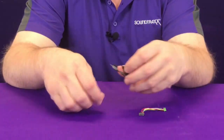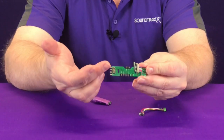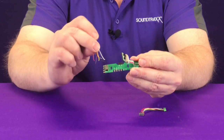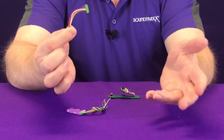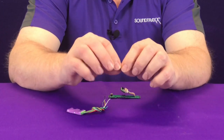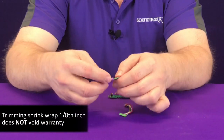When doing an installation, you can hardwire this into your model, or if you have a circuit board like this one — which came out of an Athearn Genesis with an 8-pin socket — you can either take the wires and solder them directly to the connector, or you can purchase our adapter harness, part number 810135. This has the nine-wire connector on one end and an NMRA 8-pin connector on the other.